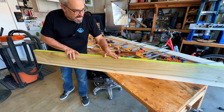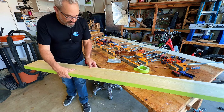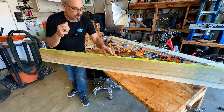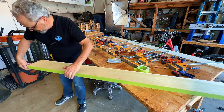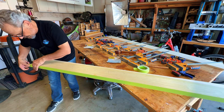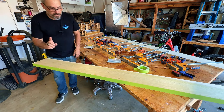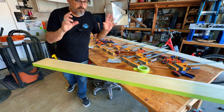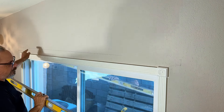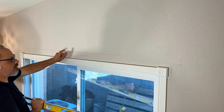I put a piece of tape on the back of the shelf. This is the top, this is the back, and this is gonna be the rounded edge - but I want to drill these holes first before I have a rounded edge on the front. Before we drill the holes we need to find where the studs are in the wall. We're gonna take this tape and put it on the wall - it'll match on the right side. Get it level and find the studs. I marked out exactly where we want our shelf, leveling across, and I'm gonna make a line on the top where the top of the shelf is.